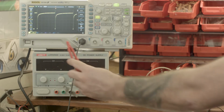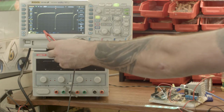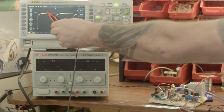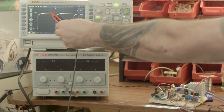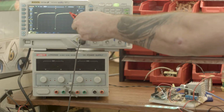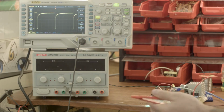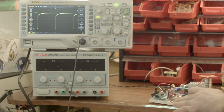And why is it? Because the light is staying on for a very small amount of time compared to how long it is turned off. So it's on here and it goes off for a long amount of time. Goes on, click, off for a long amount of time. Long is relative, okay? Because this is doing that at 1000 times a second in this case.